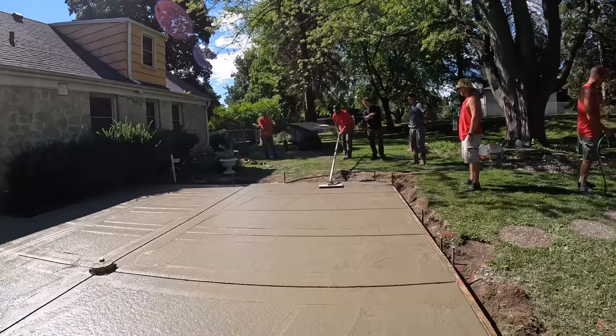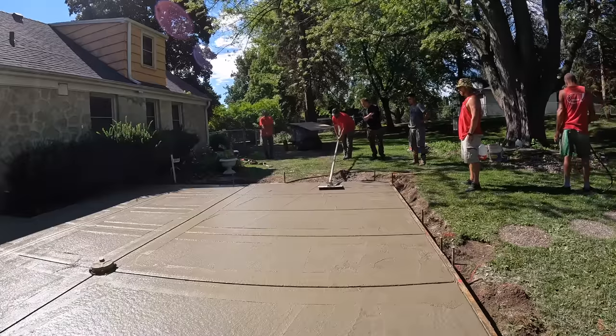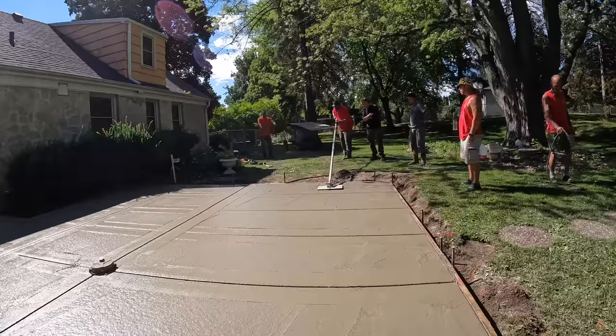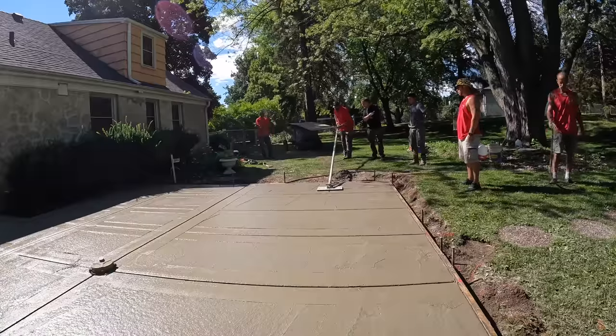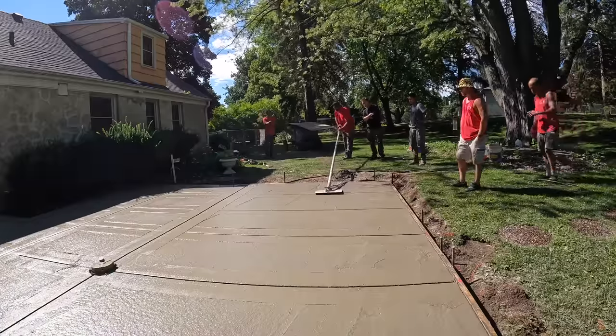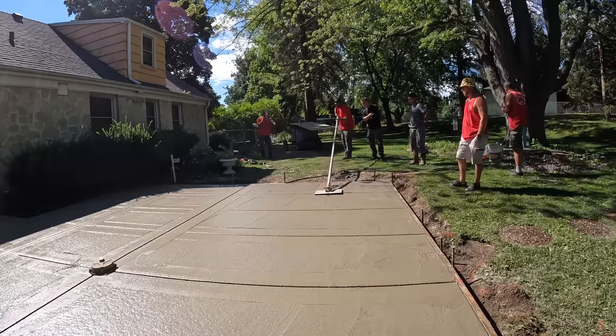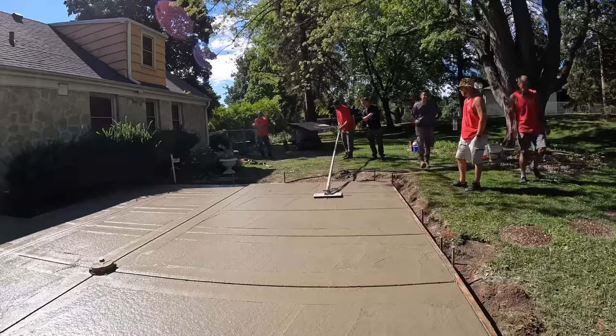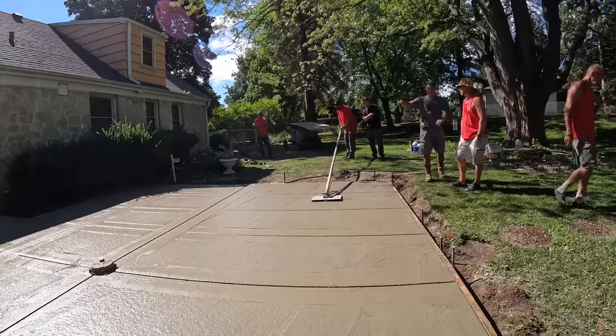And then you go out just a little bit, tilt it up, and then come back and let it sink in. You know what I'm saying? You want to cut it all the way in. Let the weight of the jointer cut the joint for you. Okay. Probably on another one. 3-4 inches at a time. Okay. You gotta work it a little bit.